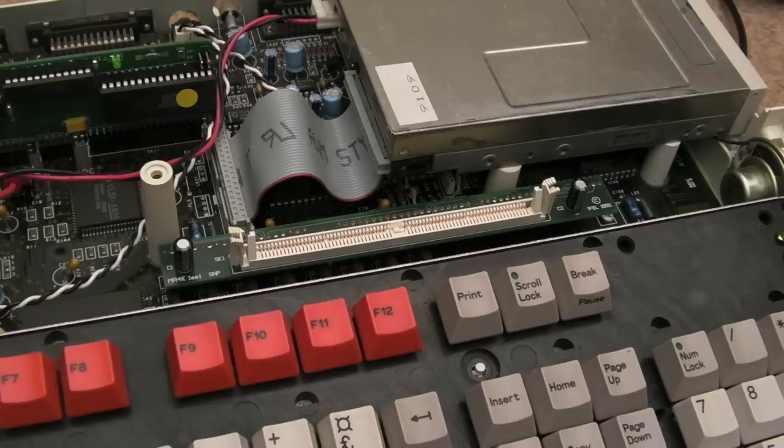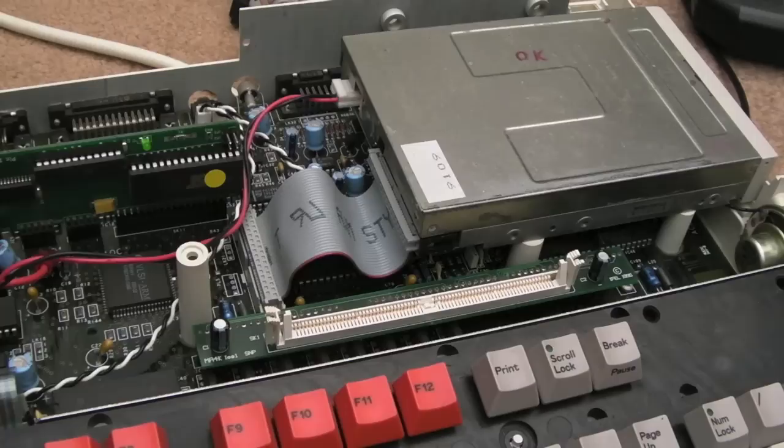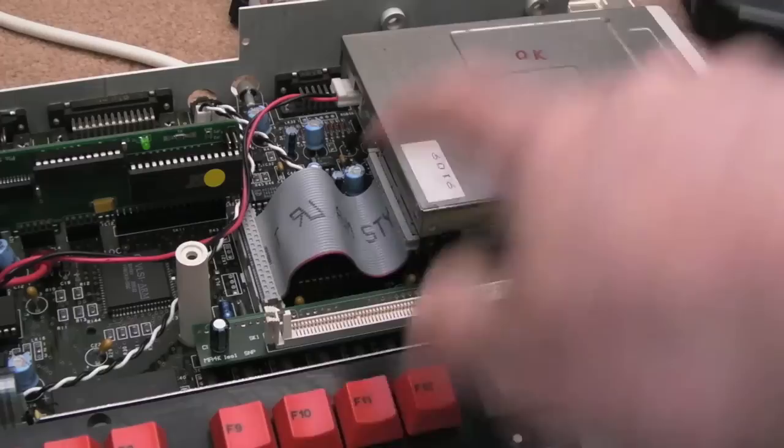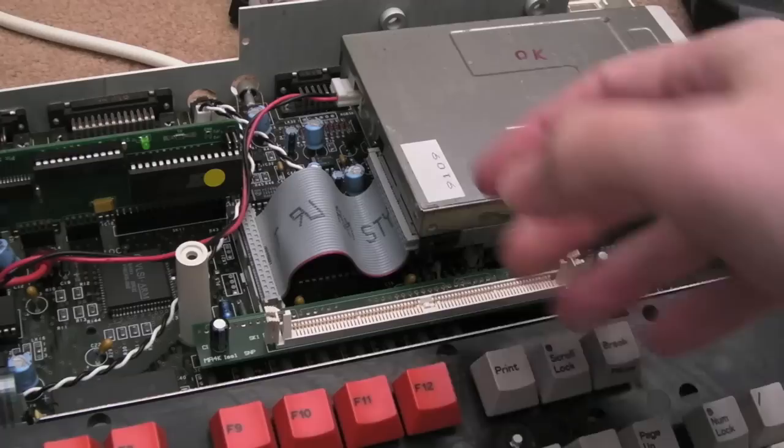So I've been testing the SIMs I've got here, and you know what I'm like, I always like to test things all sorts of different ways. So I'm just testing without a module in here. And as you can see, you get a red screen. Now that's a good sign, because what I wanted to do was test that it was actually checking this RAM here, and wasn't just assuming it was okay. Obviously it needs to utilise this, it's not going to boot without some RAM there, that's the main thing here. But the point is also that this is automatically disabling the onboard RAM. That was the main purpose of that test really.